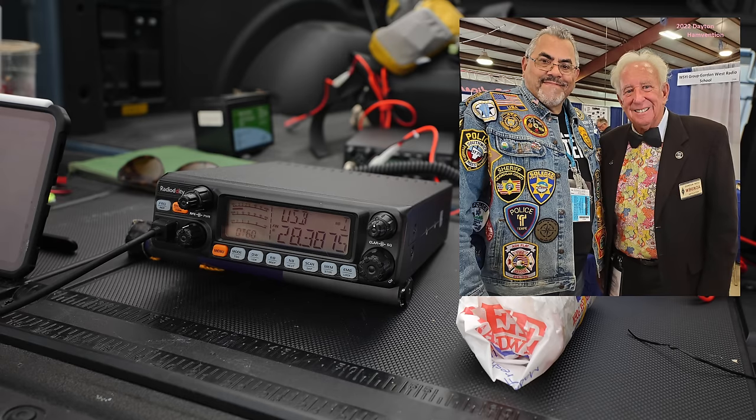QSL? Yeah, Roger. Now, what antenna, tell me about you. I know you mentioned your antenna. What antenna are you on right now, over? Yeah, this is a portable setup. I've actually got a rollover mast stand for my truck with about a 25-foot vertical mast with a long wire. I think it's probably a 49-to-1 unun to what looks like about 60 feet of wire to a tree.